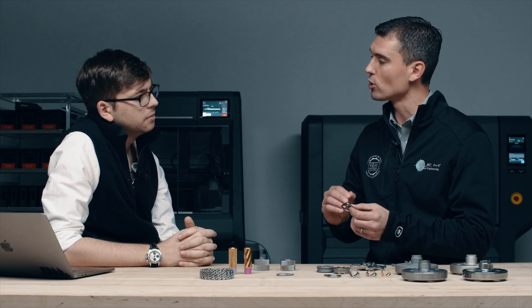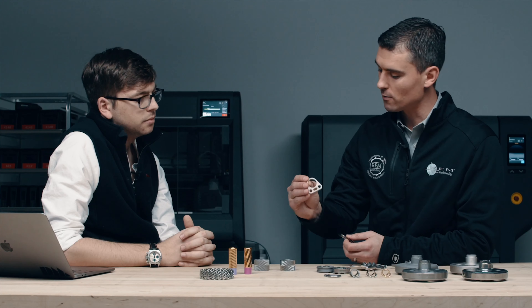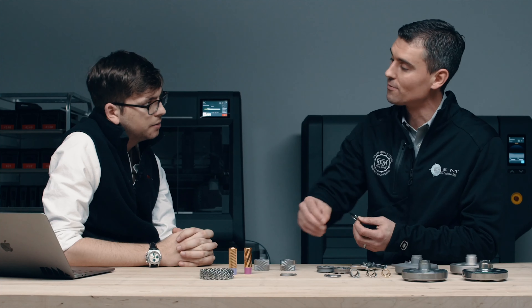Other reasons that come to mind would be that sort of dynamic bending fatigue type of application. It's not going to be bending the way a traditional bending fatigue application would be, but you are going to have variable load on this. And any of these little features — even at a micro level — these little lines, these V-notches and whatnot, those are your stress initiation sites. If you can eliminate those, you can also eliminate surface-initiated fatigue, and by doing so, you allow the actual mechanical properties of this to take over and perform to the full extent possible.